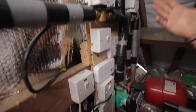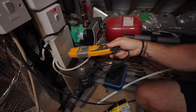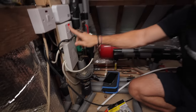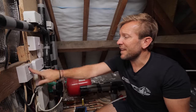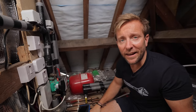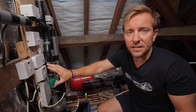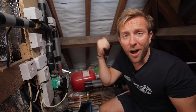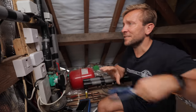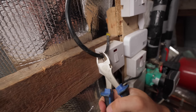The first thing you need to do is you don't have to go in here and find out, you don't have to get your tester out and do all that. No, just turn it off. Turn everything off - turn that one off, turn that off, turn that off. Turn as many things off as you like. Make sure that the power is off to the heating system. And if you're worried that it isn't, go to your distribution board in the house and knock the whole house off. Then we're going to get our snips, pull out a nice little bit of lead, and just go through that.